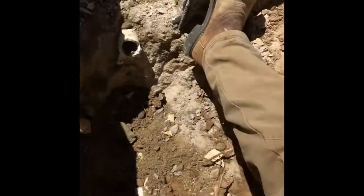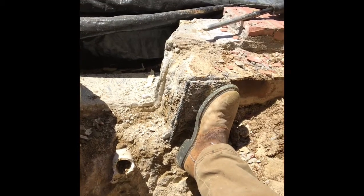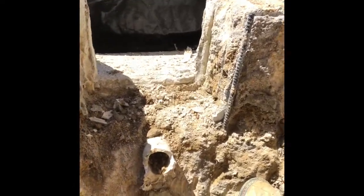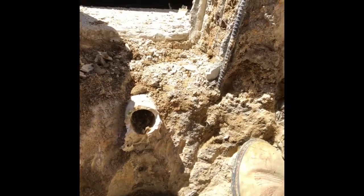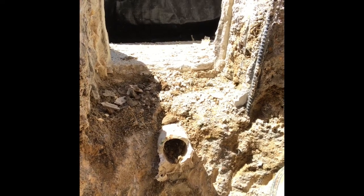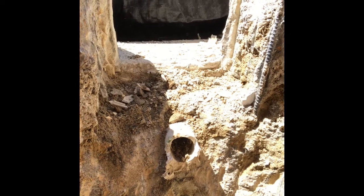The time-lapse may have stopped before I finished, but I'm going to call this skimmer demoed — took me probably about five total hours, working some on it last weekend and basically finishing it up today. As I get ready to set the new skimmers I'll do a little more cleanup here. I cut the main suction line that was connected to the old skimmer and I'm going to be running all new plumbing, completely replacing that line. As I got the old skimmer off I noticed a line going through the pool shell — I'm not sure if this used to be an equalizer line, if it was connected to a main drain, or if it was just stubbed in and never did anything. I'll figure out what's going on with that.